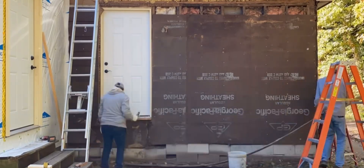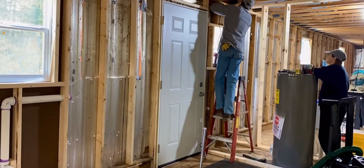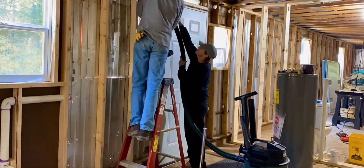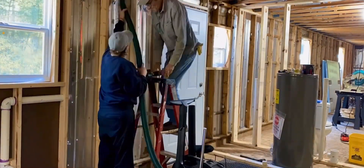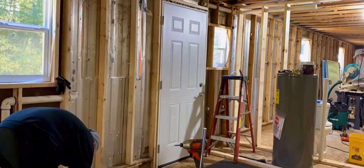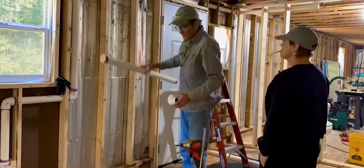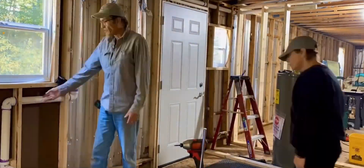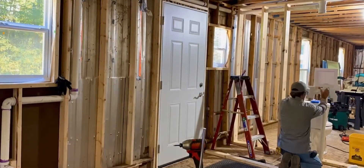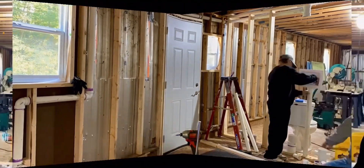Back inside, we're working on the vent piece that has to go up over the door from the kitchen sink, which is below the window on the left. We had to put that two-inch piping up over the door and tie it into the main stack. I've had so many people tell me you don't need to vent the plumbing like that, but you most certainly do — every sink, every tub, every toilet, everything with a water drain has to be vented.